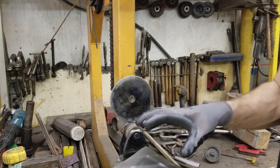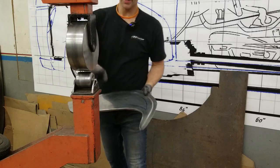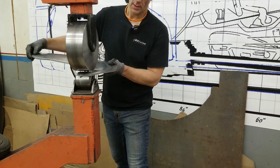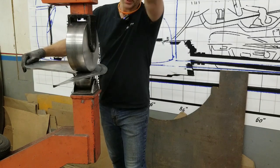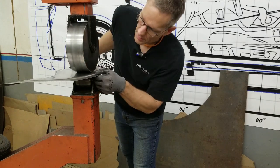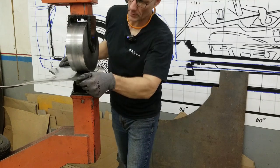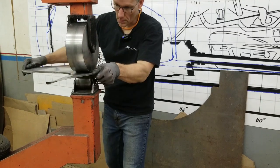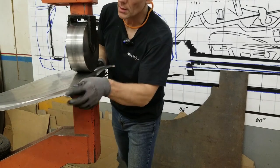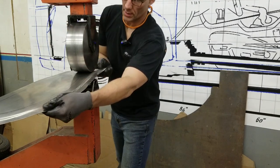I've got my high crown anvil in the English wheel, tipped up on its side just to move the contact surface — the point surface — over. Get this in and just wheel up where we're going to be creating the bead. I don't need to wheel the whole area. I'm trying to figure out my contact point — it's over a little bit more. You can see the shiny mark — that's actually where the contact surface is. And that's good. We'll come down again.